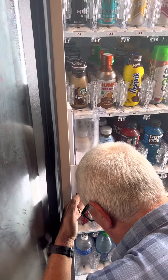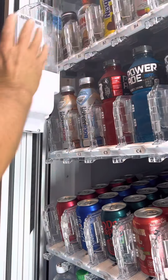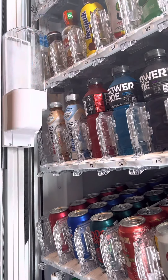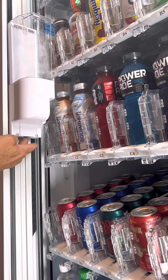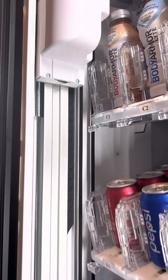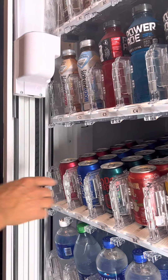It's just something I never ran across — learned one today. You've got the X mechanism and it runs horizontally. The switch up at the top when it goes back to the left is the X home switch. The Y home switch is the up and down — that's the little switch on the bottom. So when it goes down it knows. After every vend it has to go back to home, otherwise it's lost.